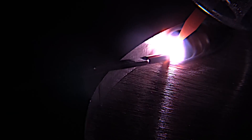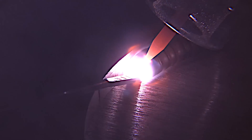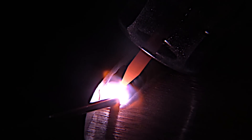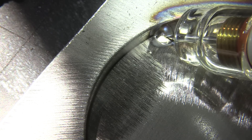For this weld, I'm using a number seven clear cup with about 20 CFH of argon. That lets me use a fairly long stick out — mainly to get the cup out of the way of the camera. Gas lenses can really help on stainless steel. Heat can really build up on stainless steel, so you want to get your puddle started early, like within about two seconds. Don't mess around, otherwise heat builds up and it's hard to outrun it.